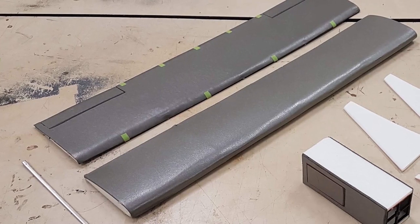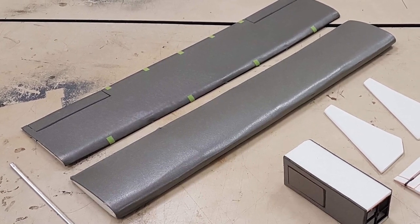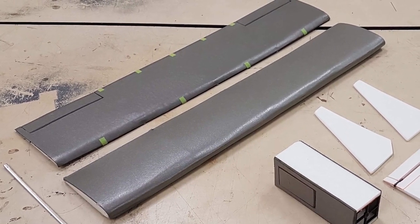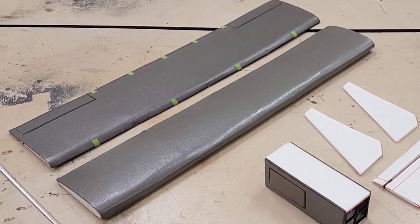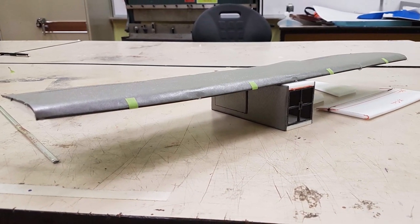My name is James Hardingham and I'm in charge of piloting and manufacturing the aircraft. After the initial design stages and sizing, we started the creation of the wing. The wing was made from foam. We used 6mm thick white Depron foam with a GOE 79 aerofoil cutout, which was covered with 2mm foam to create the aerofoil shape. This was reinforced by some carbon rods that were glued onto the leading edge and trailing edge of the wing.